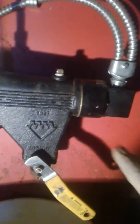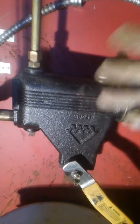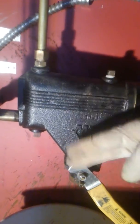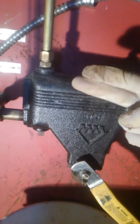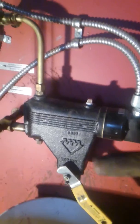There could be so many reasons why the float switch doesn't work, so many scenarios. But in this case, the float switch had a crack in it — it was inundated with water and failed to rise, so it couldn't maintain a safe water level in the boiler. I have a float switch here, so this is what it looks like.